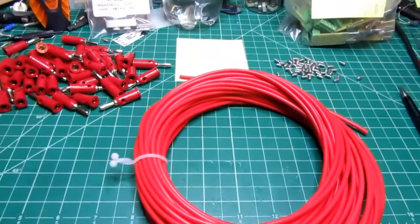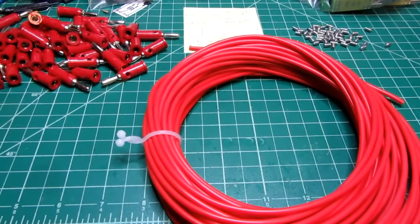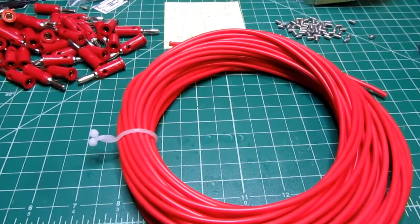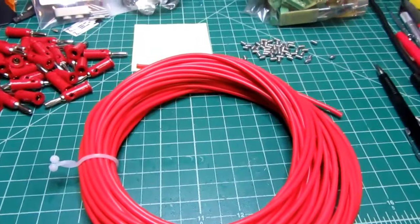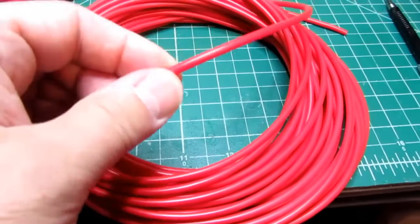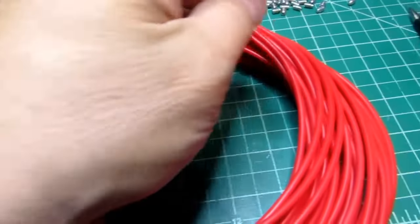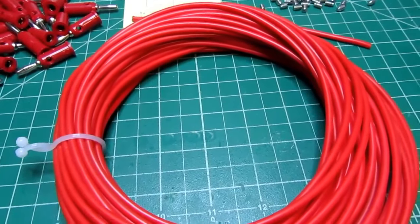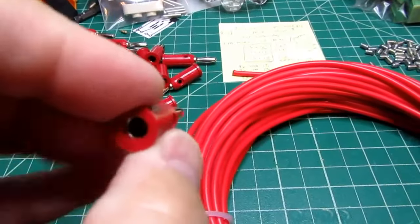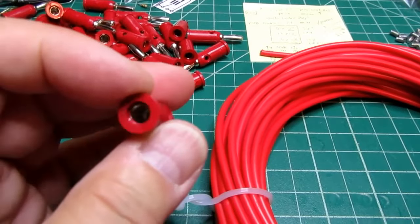Alright, I'm just going to tack this on to the end of the EC-1 module video. My EC-1 came without the patch cords, as well as being absent any of the modules. So I'm going to build them according to the Heathkit specifications. I have a roll of Pomona silicone rubber test lead wire. Fairly premium stuff, and probably not too dissimilar to what Heathkit would have originally supplied, as well as a big pile of Pomona banana plugs of the stacking kind. I think the original Heathkit ones were not stacking, but Pomona only has the stacking kind now.